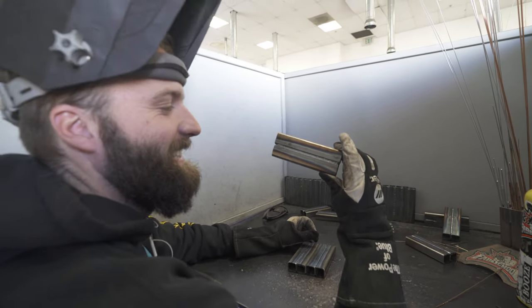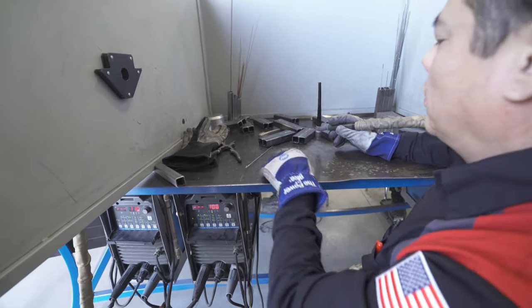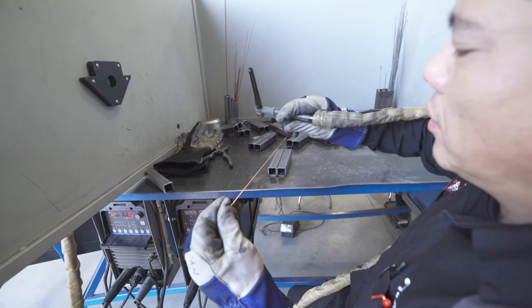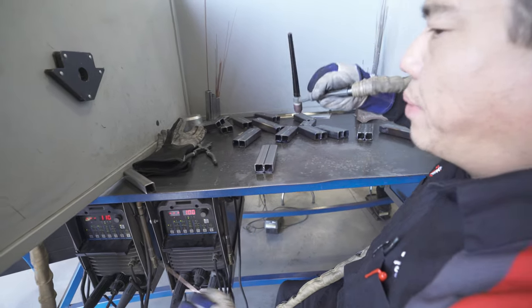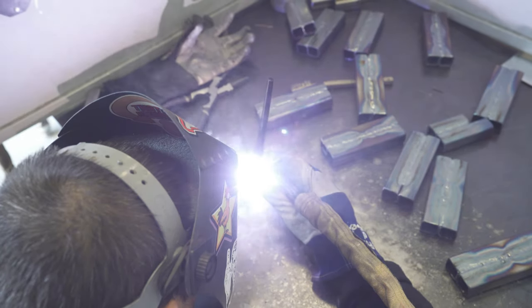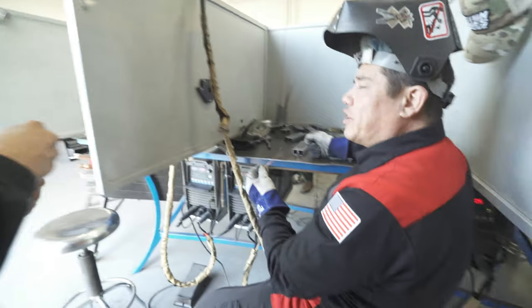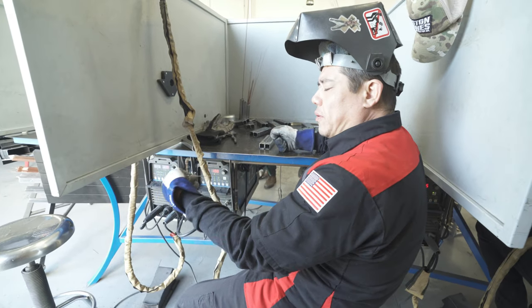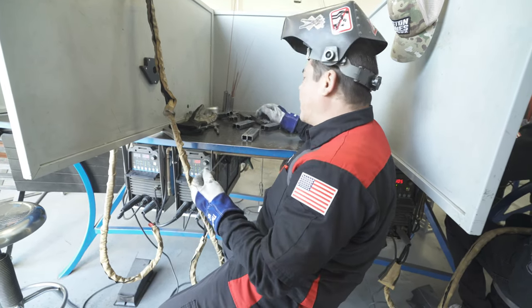I'm going to give a little continuous demo at 100 amps. He's getting a little hot and dull, so I'm going to give him a better understanding of how to control your heat. You see my hand speed was a little bit faster — you've got to dip a little bit faster and a little bit more. Just steady, steady, steady. Think of it as: the more rod I can add to my weld, the more I can displace the heat. If I can add more rod, I can keep my weld a little cooler.